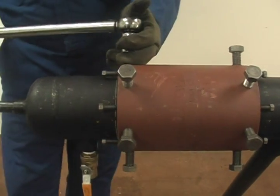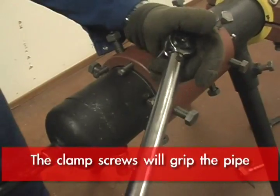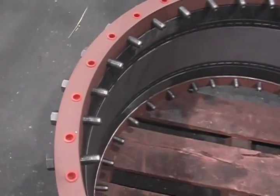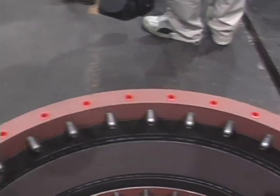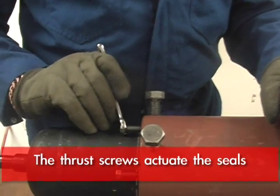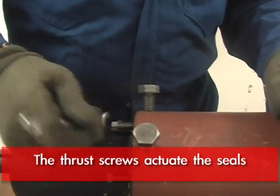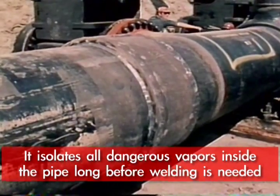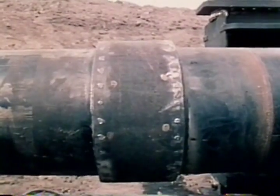There's a row of bolts called the clamp screws that grip the pipe and provide some anchoring. And then there's a row of bolts out the ends that actuate the seals. So in effect, what you're doing is isolating any explosive vapors inside the pipe from the outside parts of the fillet weld, where you're going to make your permanent weldments.